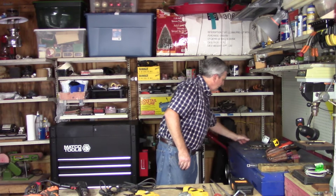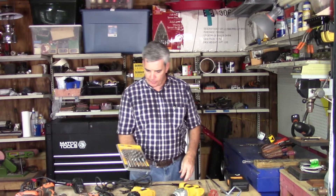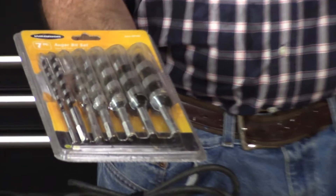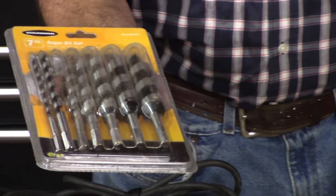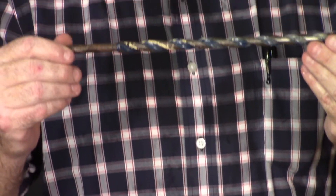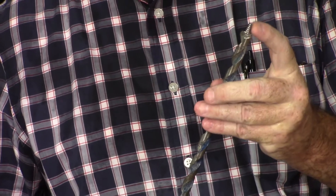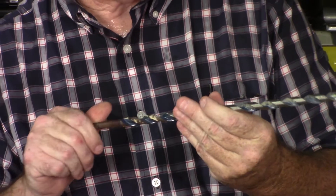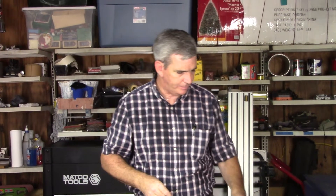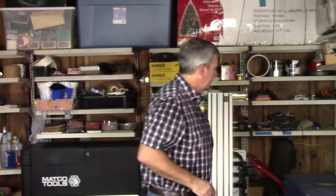Next are auger bits. Say you're running wires in a house or in a screened-in room — a good set of auger bits works well. Sometimes your auger bit has to go through something like a six-by-six, so they have a screw tip on the end to help pull through. When you get to the very end you can either pull it out and come in from the other side where the tip came through, or just push hard and you'll get it.